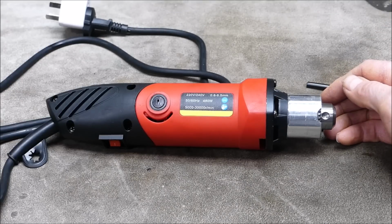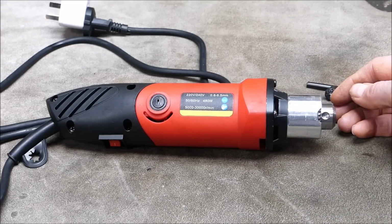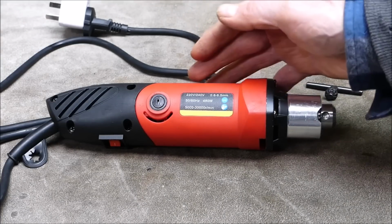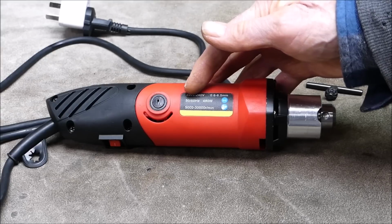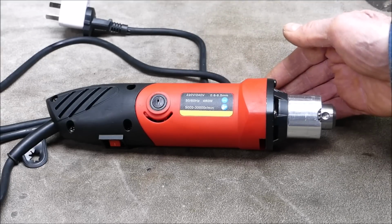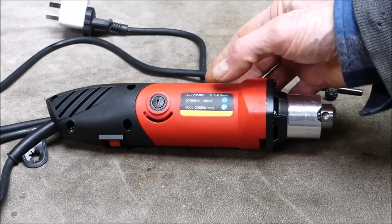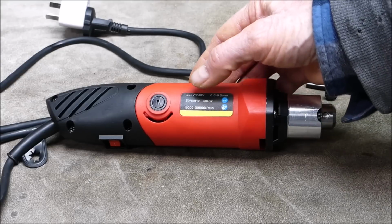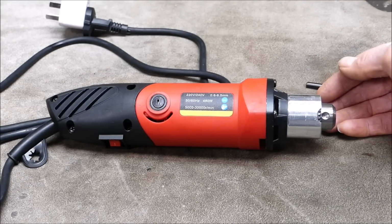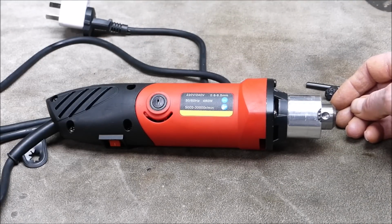Well, to clarify this low speed issue, I went back through my videos, my earlier ones, and I found I had actually done a video on this same issue with the Drill Pro Hilda 400 watt unit. Exactly the same situation. When I finally got around to testing the low speed range of the unit, instead of pulling 5,000 RPM, the same as this one, it was actually pulling 17,000 RPM. I mean, we were pulling 16,000. But this one, of course, hasn't freed up yet. The Hilda initially pulled slightly lower top speed than quoted, but then over time that increased as the thing loosened up. You know, the bearings loosen up mainly, and that's what happens.